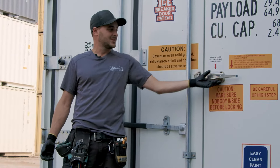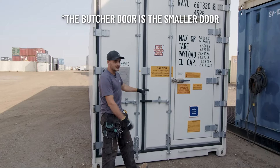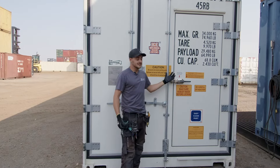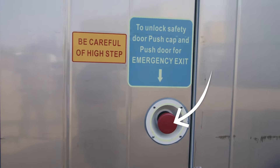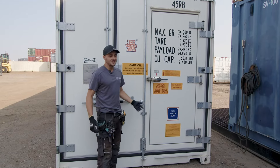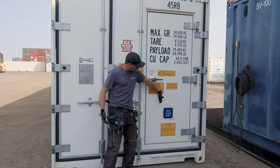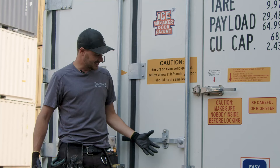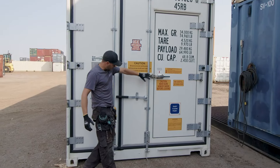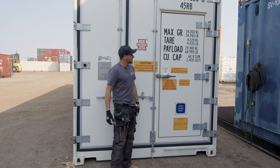Something really nice about these: they have an access door inside called the butcher door. It's a wider, tall door for bringing larger objects through, but this individual door opens from the outside with a key - it's lockable. When you're inside the container there's a panic button so you can get out. A previous version of these reefers had the lock rod tied into the latch mechanism, which was very complex and could jam if the container wasn't level. They've since made this door wider, keeping the lock rod free and clear, and now use more of a regular refrigerator-style hardware - a huge bonus.